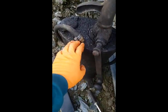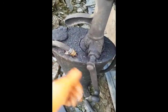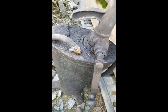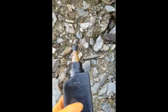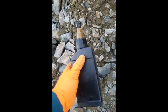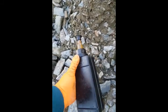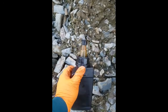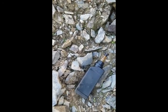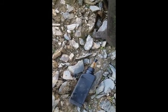It's an old gear oil pump. You have a nozzle put into a little hole like that, and then you wind that round to pump it out. But if you don't have one of those, you can use one of these. It's an old 2-stroke bottle. Always handy to keep these. They're good for this little nozzle, and you can go into different places. Good for gear oil into gearboxes and hubs, and I also use them for putting power steering oil into reservoirs. It's a bit awkward to get at them with a jug. These make less mess.